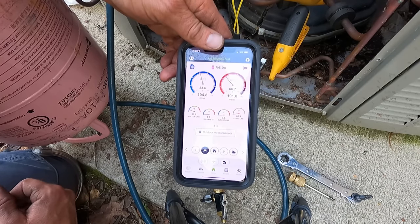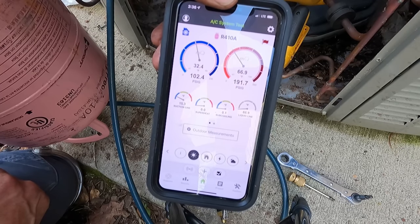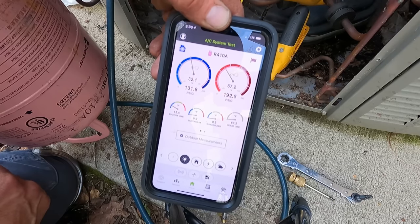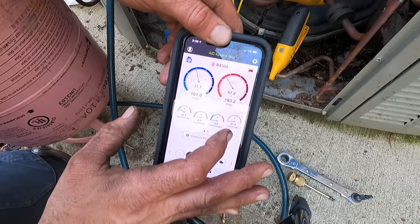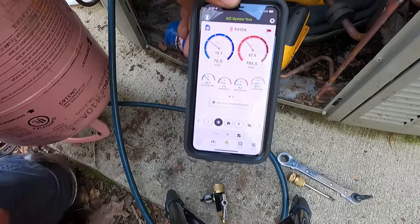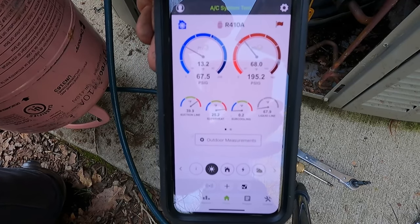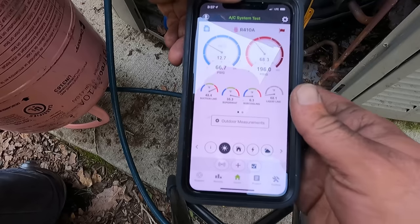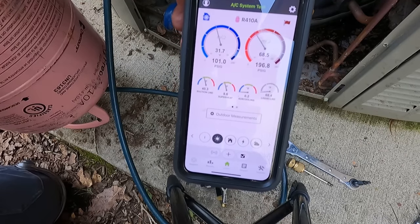It's not even gonna get it high enough. No, I do have a little tiny bit of subcool that popped up, but this can I don't think is going to be able to do it. It's pulling. And where's it going? Nowhere. I mean, 67 is our liquid line. 16 is our suction. And we still have 100 PSI. Okay. So, I mean, you can see it's not really returning yet, so let's add more.